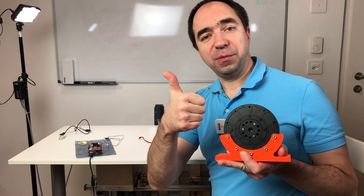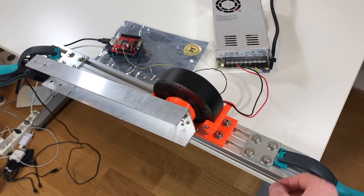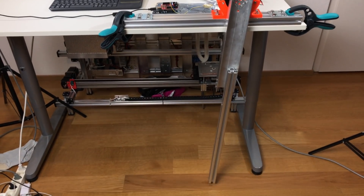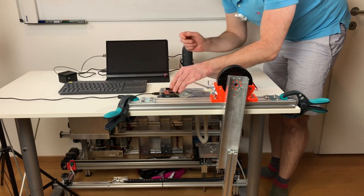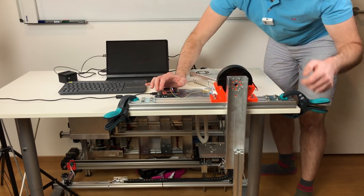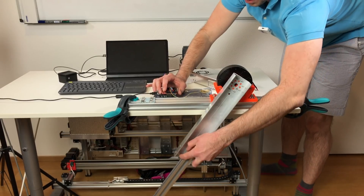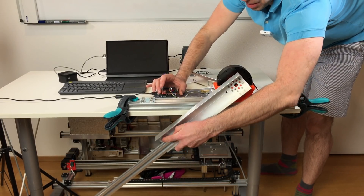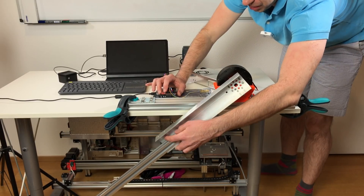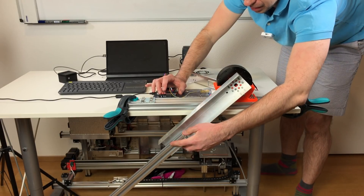Next let's look at the performance — the estimation of the backlash and the torque. For this I'm going to attach a long arm to the output shaft. I have fixed the actuator to two aluminum beams clamped to the table, and I've attached a really long arm. Motor power is on, Arduino power is on. There are huge oscillations — this is a problem with the PID. When I dampen these oscillations with my hand it's okay, but it's kind of too rigid. It's actually scary.